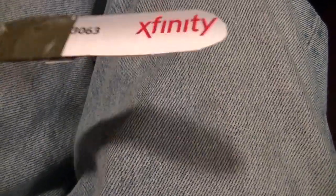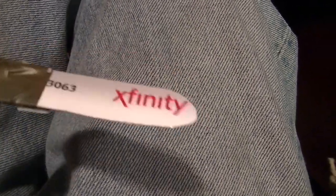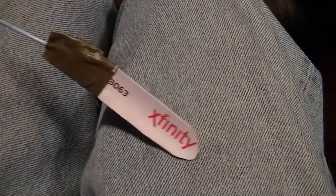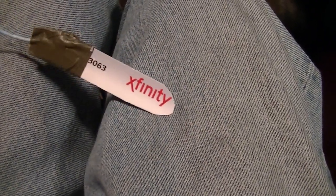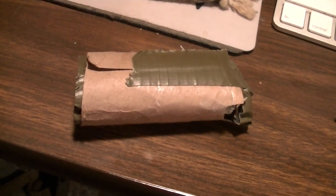This is one of those fake credit card things that come in the mail all the time. It's a piece of paper I'm going to put glue all over, slather it in between the brace and wipe it back and forth. And obviously there's a length of coat hanger here so I can get in there — it's a small hole. I'm going to do a couple of dry runs to make sure this thing can actually go in there, then wipe up the mess from the glue, stick that thing in to clamp it, and leave it overnight.